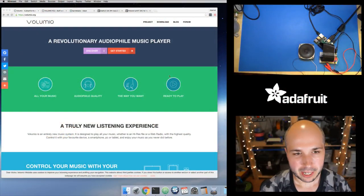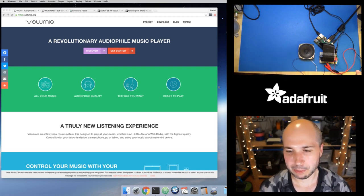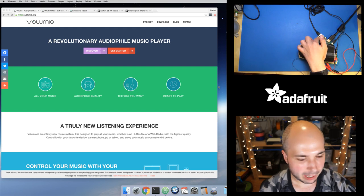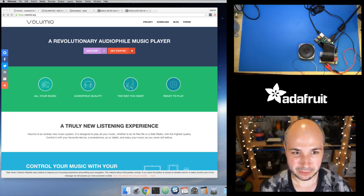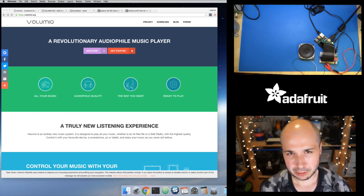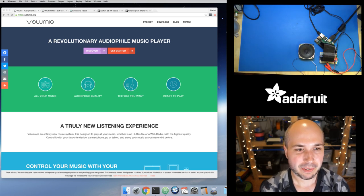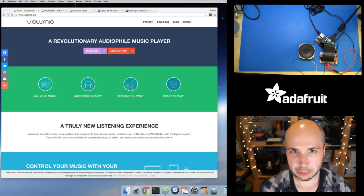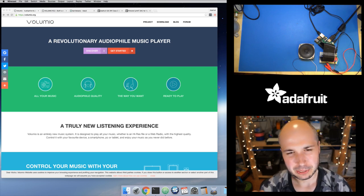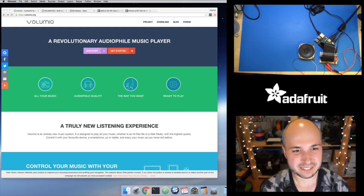In the upper right here I have a Pi 3, but the type of Raspberry Pi doesn't really matter much — this would work fine on a Zero too. You do want some type of audio output from the Pi. On the Pi 3 you've got the analog audio jack. For a Pi Zero you'd need a USB audio adapter, which means a USB on-the-go adapter and probably a USB hub. So just be aware it's not completely plug and play.